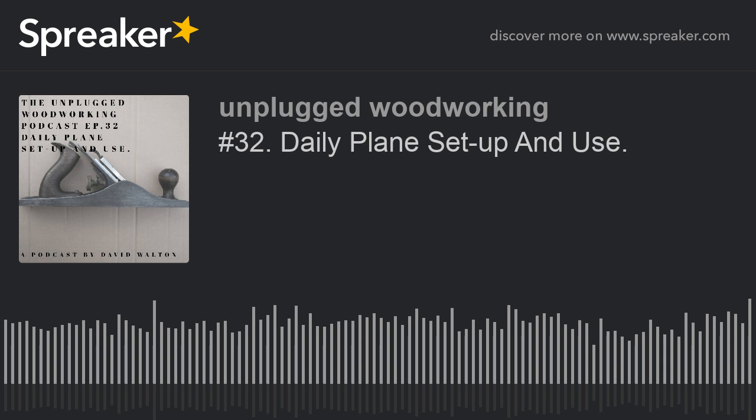But when you're doing this, look at the shavings you're getting. Listen, you'll be able to hear the difference. If one side's cutting more than the other, you will be able to see the difference, you will be able to hear the difference, and you will be able to feel the difference. If you're paying attention, don't have any music on, don't have any distractions, you will definitely see the difference. When I feel I'm taking equal shavings from the left side and from the right side, I'll take one from the middle. If that feels good, I'm happy, and that's me away.